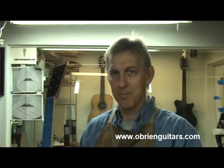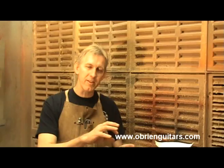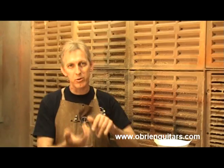All right, here we are back in the spray booth for hopefully the third and final day. You're going to see me mix the lacquer. What I like to do is mix it not in the gun, but I'll mix it separate because I'm going to dilute it. I want to stir it up and then pour it into the gun. If you mix it in the actual gun itself, sometimes your first coat will come out very watery or too thick. So I want it all to be consistent.